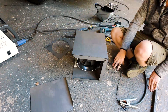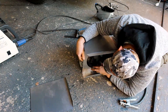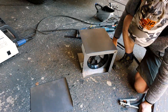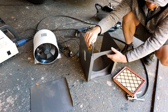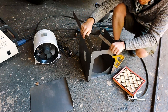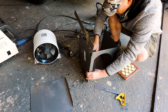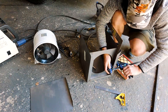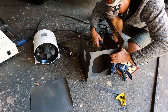I started the design of this box by first finding a suitable air filter. I wanted an automotive engine filter as I know they don't let any dust through and it will be easily replaceable at any spare shop. This one is from an Opel Astra J series. The divider you see me install in the box is to separate the suction side from the air outlet. Without this the fan would circulate the air around itself for the most part — it's way easier drawing air back to the intake side than sucking new air through the filter. By creating these two compartments I now force every ounce of air being moved through the filter.